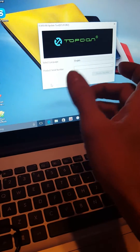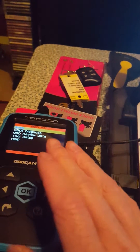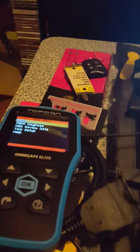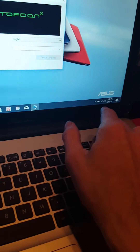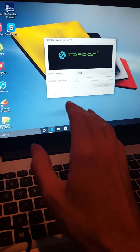So if you buy this unit, hook it up, update it, and the device tells you to reboot — the only way to reboot is to unplug and replug the cord from your laptop — make sure you safely eject it through Windows first. Don't just yank it. If you have the corrupted card problem, format the drive to FAT32 and download the TopDon update program from topdon.us, then restore the unit.